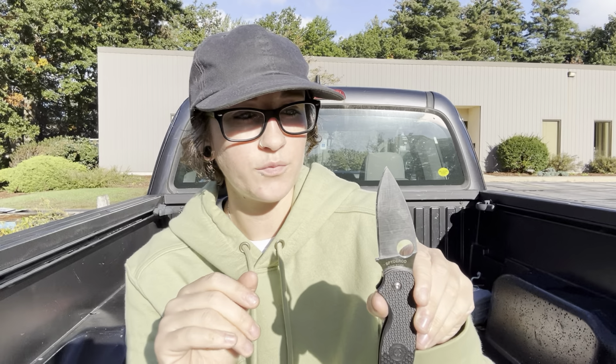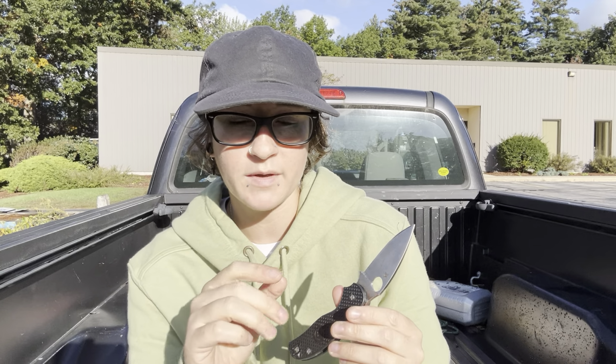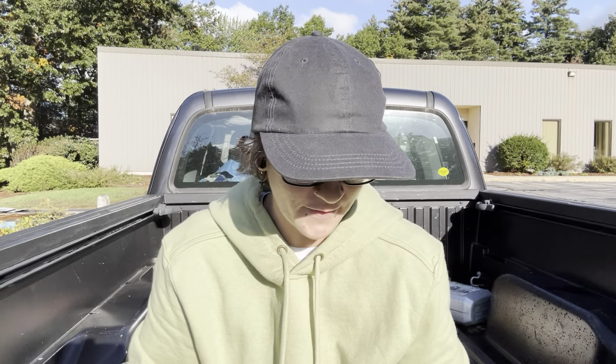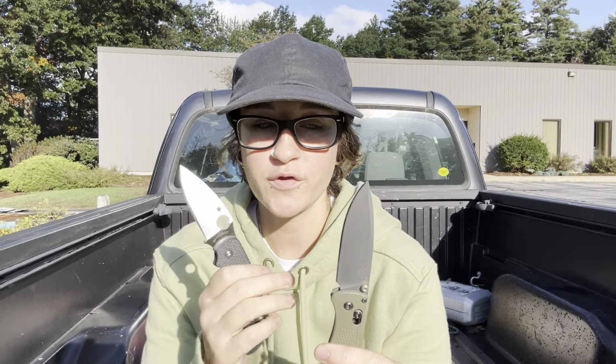And with the Sage 5 Lightweight, we did the 600 grit DMT stone working edge, stropped it with, I think, 1.5 micron spray that Michael made, like diamond emulsion spray, and then maybe 1 micron gunny juice, I think. It's so hard to remember all of this because we've been using these for a month. But what was interesting was the edge retention on the Benchmade Bugout in S30V was above and beyond what it was with a working edge when it was polished.